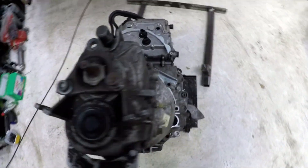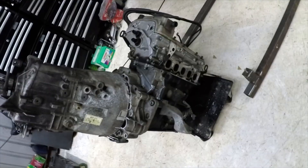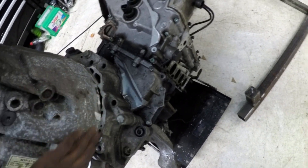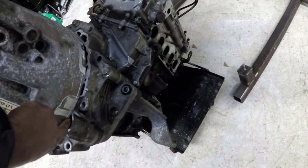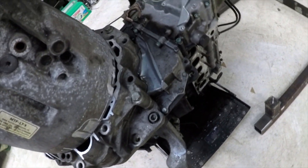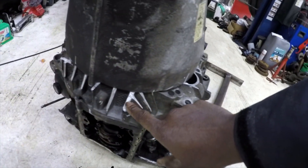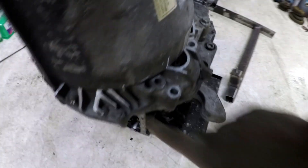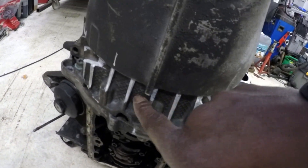I thought I'd do a little update on the VR5. I'm getting close now to being confident to start welding this up. What I've started to do is just trim the gearbox to get it ready - it still needs a good clean and degrease in terms of v-grooving the edges. I've also started to trim some of the fins off the front part of the gearbox just to give me space to get in there and weld along the edge.